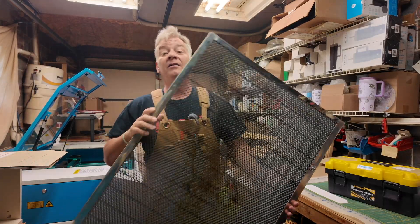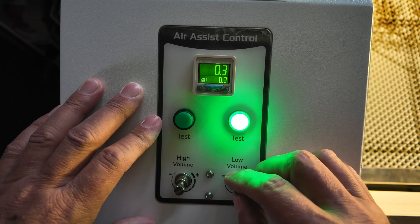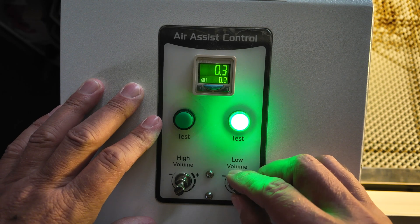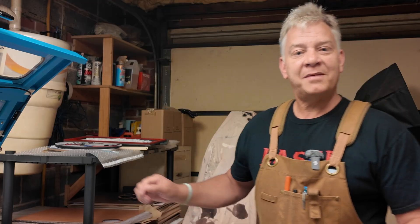Because we're only going to be cutting today, I've removed the honeycomb out of the bed. We're going to cut on the blade table and I've removed the six millimeter tip and replaced it with a three millimeter cutting tip on the bottom of the laser head. My mirrors and my lens are clean, I've already calibrated and checked my air assist for proper pressure, and we're using the two and a half inch lens. So let's finish that build today on LaserNug.